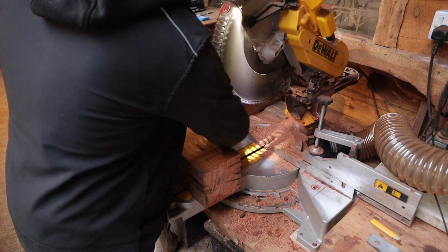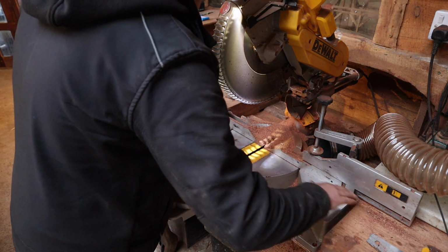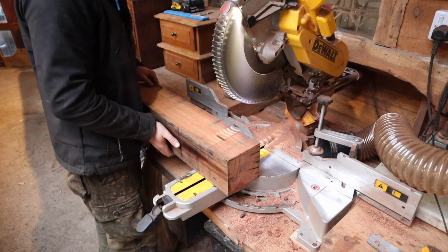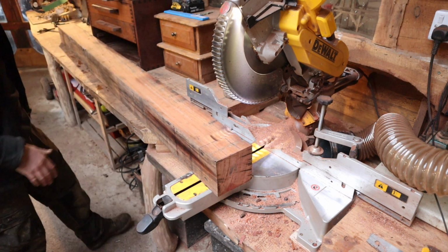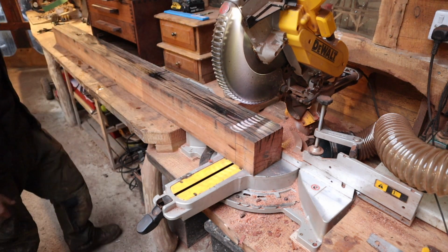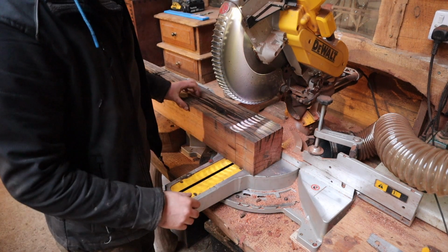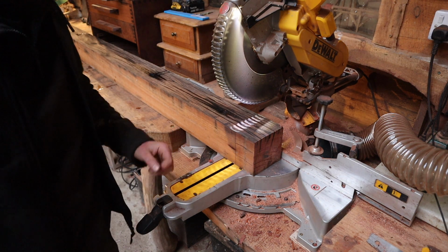It takes me maybe like 3 minutes or something to sharpen a plane or a chisel up to about 1200 grit with a belt sander, and that's what I use because it's just so much faster. Whetstone is still very nice, having a hand tool workshop and sharpening with whetstones up to thousands of grit, but I haven't got the time for that. I'd rather just get something sharp and just use it, so that's my method.